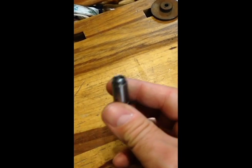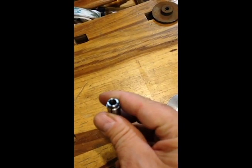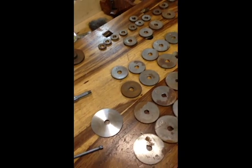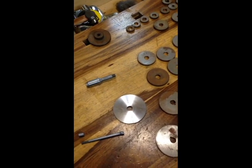Finger tighten the actual collet drawbar first, and then it sits up snug enough finger tight that once you seat the gear on the back shoulder, just a quarter turn crank with a screwdriver — and this was made and slotted on the lathe as well. It just expands those fingers beautifully, and I'm looking forward to using it for what will be a bit of a job here to get all these cleaned up, but the fact that it's working so nicely is very fun.